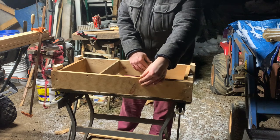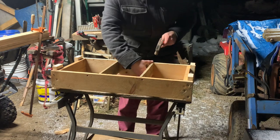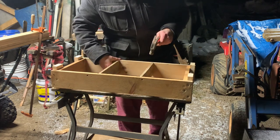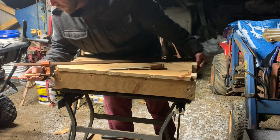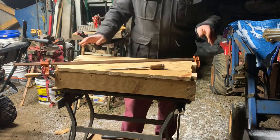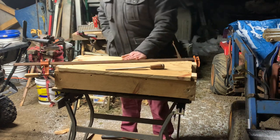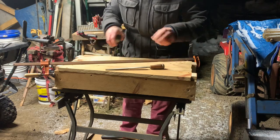Timber! Let's hammer. Gingerly set that. All right, so we're going to pull this into square, because when you start nailing these floorboards in, if it's trapezoidal, it's going to stay that way. Before you nail your floor on, I call these the floorboards because if this were a crate, this would be the floor of the box.